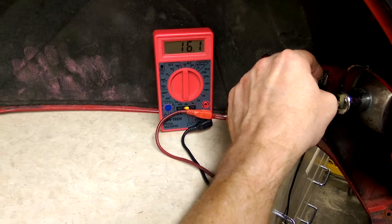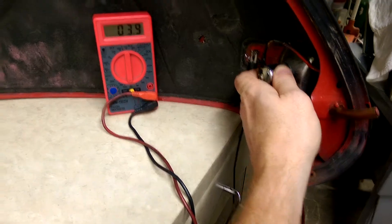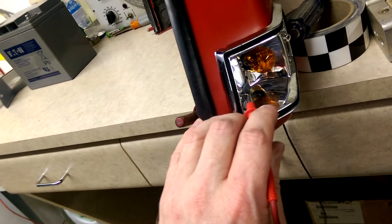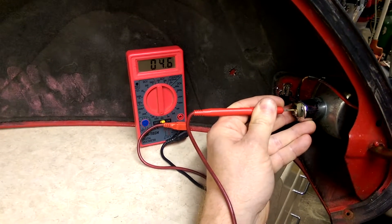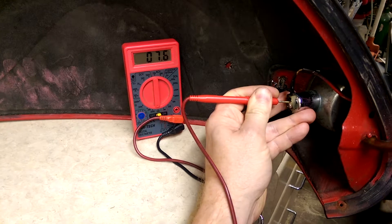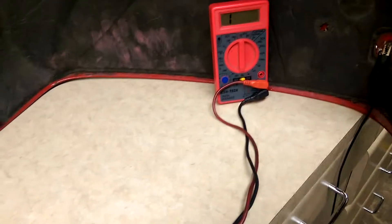Some of these meters have a buzzer that makes it really easy. As we go through here, if we have good continuity at the chassis of the socket — which we do — if we didn't, we can start checking: do I have it right here at this screw? If I have it at the screw I should have it at the strap. If I have it at the strap I should have it at the base of the bulb. Going through the bulb, I should have the resistance of the bulb, which would be slightly higher — a little bit more resistance — and then all the way back at this pin.